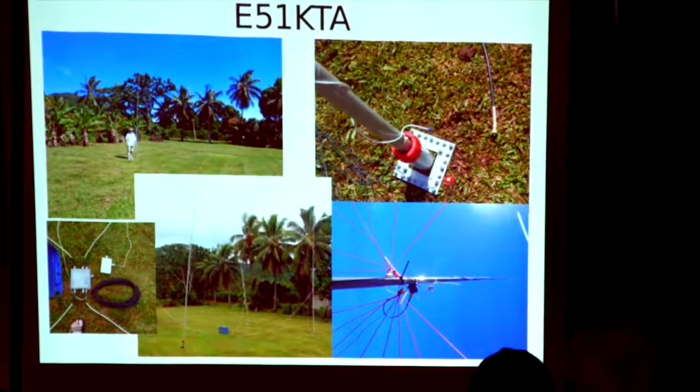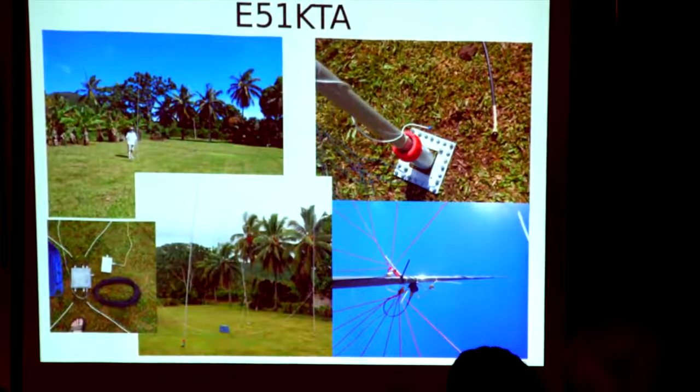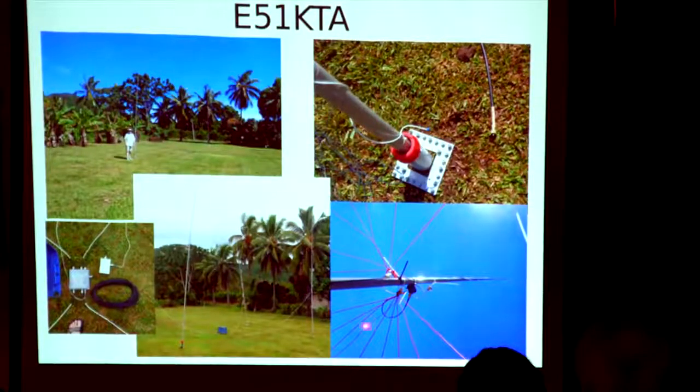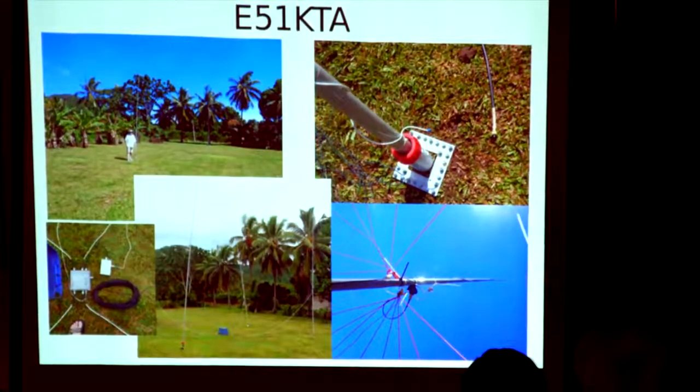It's very important to have a decent ground plane. You make a very simple square of aluminium, connect whatever wires you've got, and make a ground plane. This is actually 30 metres, so the feed point is about 2.4 metres above ground. The reason the antenna wire is rotated around the mast — it's like those chimneys by factories with fins on the outside. If you get wind from one direction it creates a vortex-type torsion in the mast, which means the mast stays vertical. You hardly need any guying whatsoever.